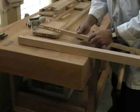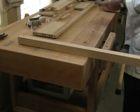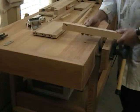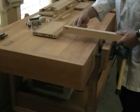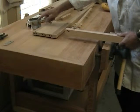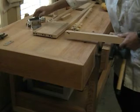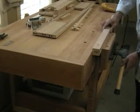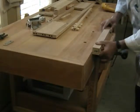This will again show you just how accurate the dowel jig is when you see this going together. Now what I want is an offset — this is the front of course — and I want an offset here of about a quarter of an inch. So I have a half-inch spacer — that's a three-eighth and an eighth of an inch spacer — between the reference bracket and the reference block. So I'm going to place the workpiece in the vise.